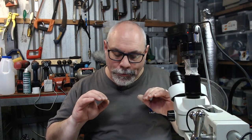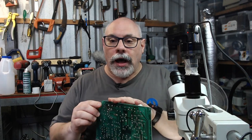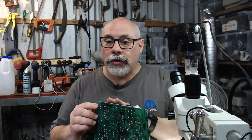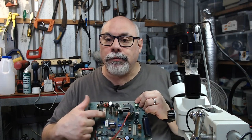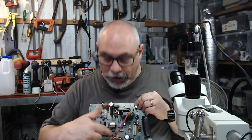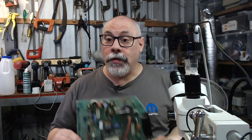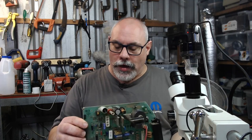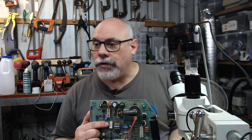And I'm also then going to go over the things that I do in order to give these boards a check over. It's very common for these old Mac Plus analog boards to end up with cracked solder joints, specifically around the flyback transformer, which is this fellow just here, or around the jumpers, the plugs, the plug hole thingies. What's the word I'm looking for with those? But anyhow, the plugs. So I generally go and have a look at those. I inspect those, make sure there aren't any cracks in them, and if there are, I fix them up.